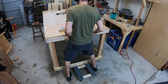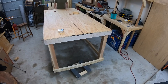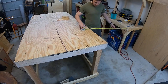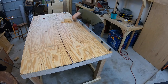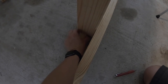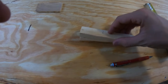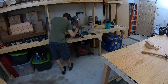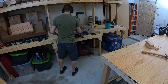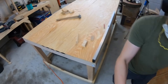In order to move the workbench into its final location, you can use a furniture dolly on one end and then lift up the other end, rolling it into place. And once it's in its final resting location, you'll want to level everything out. You'll go leg by leg, typically working from one corner inward until all the sides are level. Here I'm taking two shims and pushing them underneath the leg. I can mark out where the shims meet the leg when resting on the floor, and this gives me the height that I need to cut my block to. And once that block is cut, you can walk over and put it underneath your leg, and with that everything is leveled out.